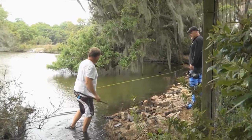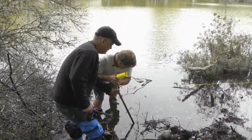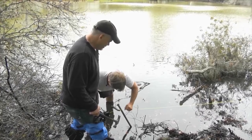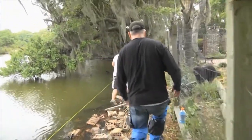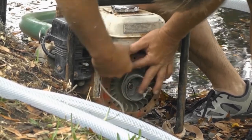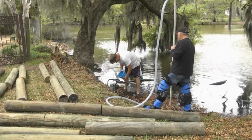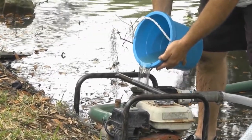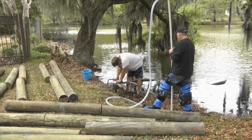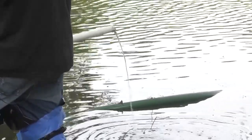He does not even know what he's getting himself into. I've got my improvised bag boots on. Now setting up the pump system — it sucks in water there and blows out water here; pressure blows a hole. It's just the jetting of that water off a small generator that makes the hole. This is old school stuff — this is how they did it back in the day.